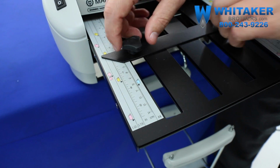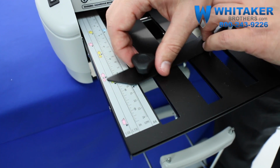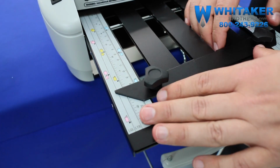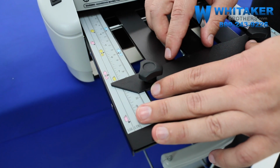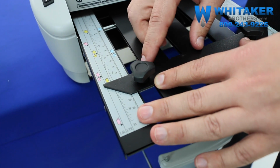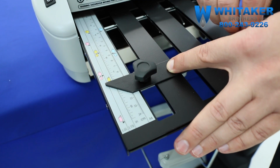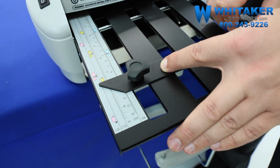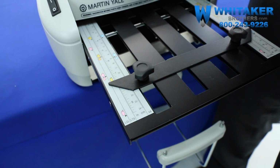this machine. So I'm going to loosen up these thumb screws, and I'm going to move the fold plate such that it lands right on this arrow right here. So I'm going to try to be as precise as I can. Looks like I've got it on both sides. I'm going to apply pressure here, which will hold it in place, and we're going to tighten those screws. So there, we've done it for that side. Now we'll do it for the back side as well.